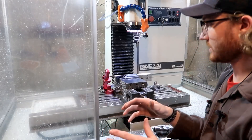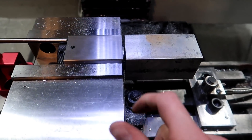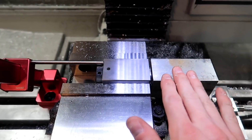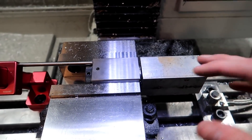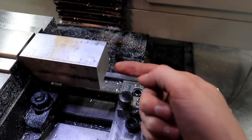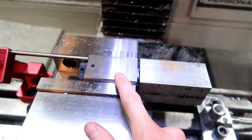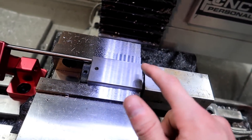I'm going to index this collet block here. You saw me mill the one-inch stud, which fits in this collet block here. I have a one-inch collet and I have it on a stop here. So basically, I'm going to mill one side, flip it around, and have the same exact zero point, which is right in the middle. It'll stay in the same place every time because this collet block is as accurate as it can get — it was from Amazon.